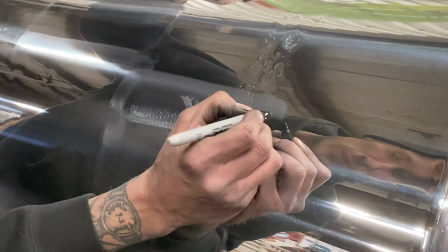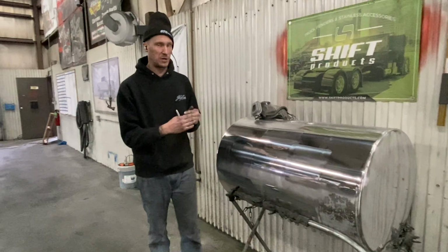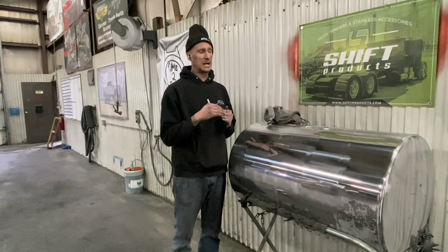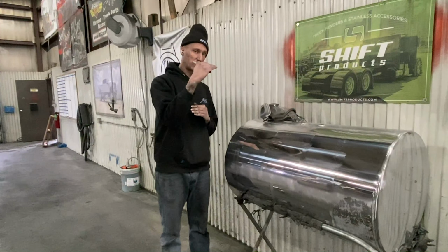Now, if we get over into the heavy part where it's really super hashy, our shine line is down here and our black line is up there. We're almost a full inch. So as we get consecutively heavier, the hash marks get heavier, but our overlap also widens as well. And the compound slings off even further in front of you the heavier you get.